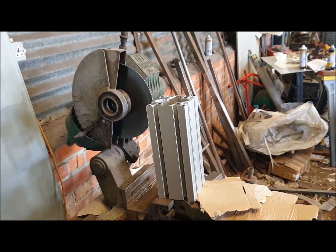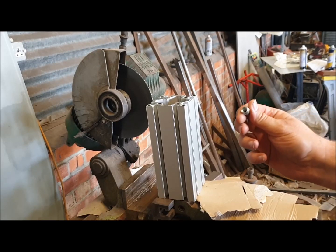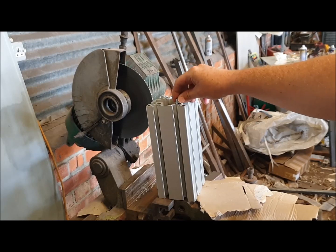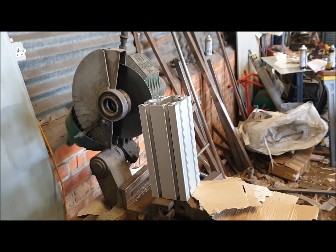To fit these, you're supposed to just use an Allen key, because there's a little hex broached into the inside of this insert, and you basically just screw it into the four holes in the channel. I'm a little bit uncomfortable about doing this because the first one I tried got stuck, but I've managed to repair it. I'm not 100% sure what size Allen key to use — the 6mm Allen key is too small, and I haven't found an Allen key set with a 6.5mm.